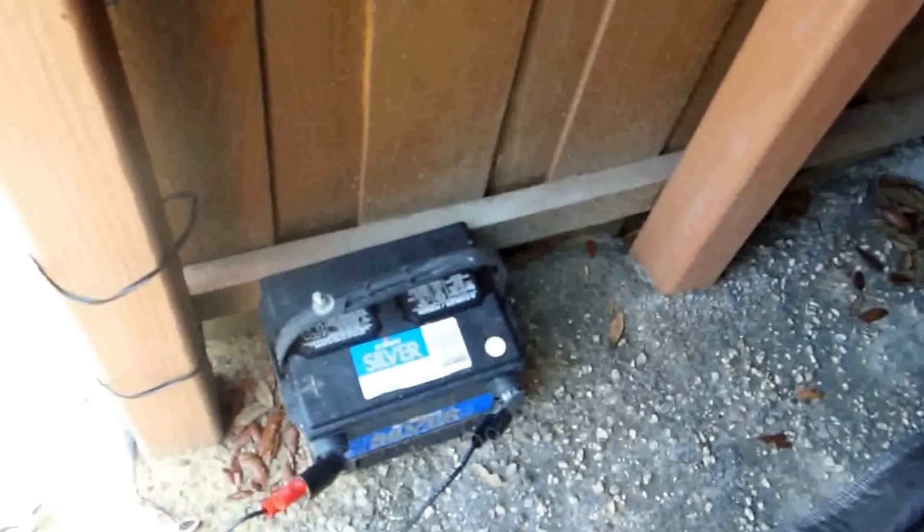This panel is 12 inches long and 4 inches wide — just right. I've got a stake down here with a couple of nails to keep it in place. You don't need a charge controller if you've got several batteries you want to keep charged up. Just keep these panels in the sun — they're too small to overcook the batteries.